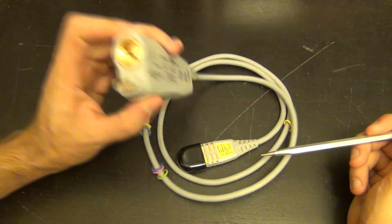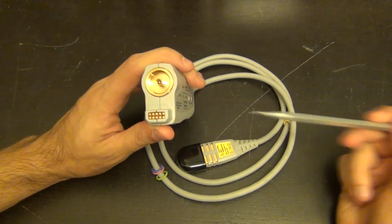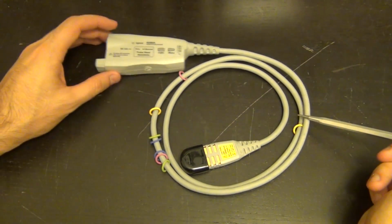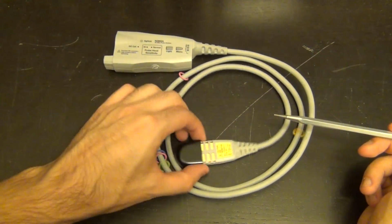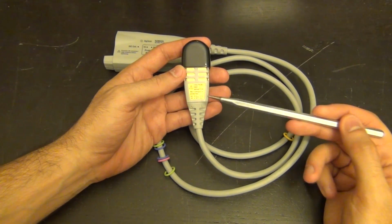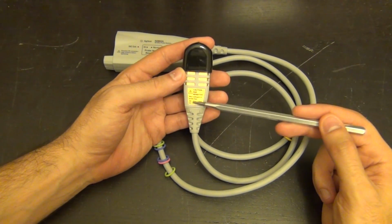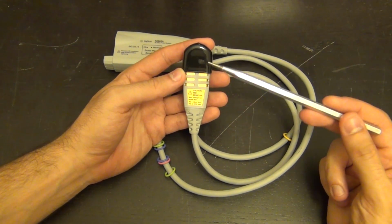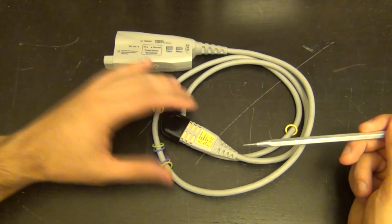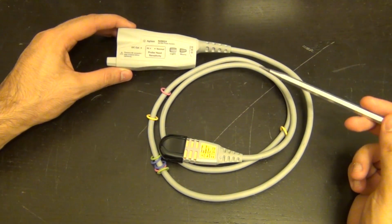So anyway, I don't even have an X-Series oscilloscope here in my lab to continue to work on it, even if I wanted to. So I just bought it, paid $170 or so just to make this video. I thought it would be very interesting to take it apart. Now, these things can accept up to plus and minus 18 volts of DC voltage. So they are hard to kill that way, but they can only take 5 volts of AC. And of course, they are ESD sensitive. So I'm not sure how this one had died. The person who sold it didn't know, but it's definitely not working other than that.